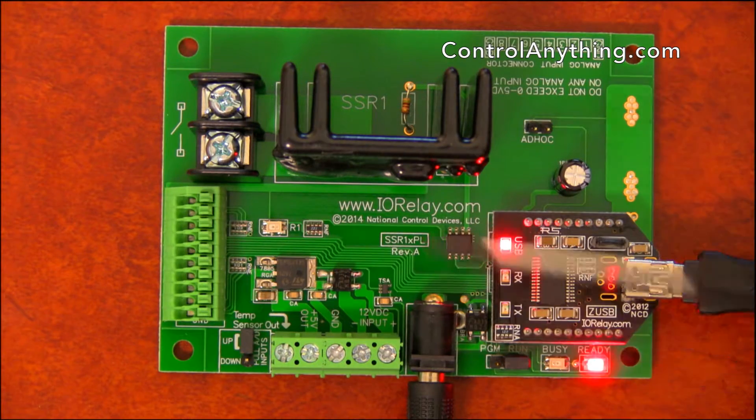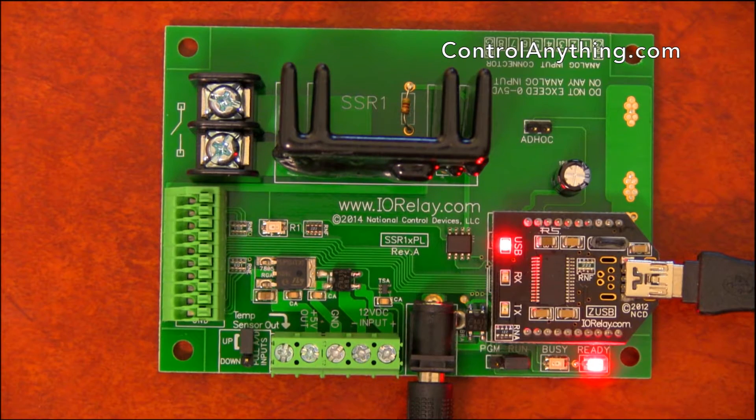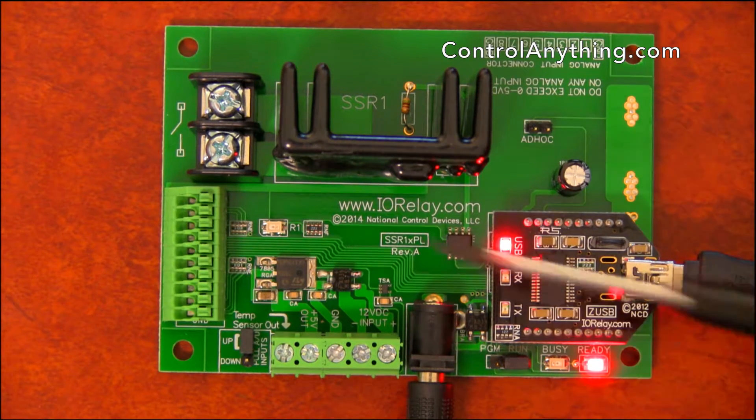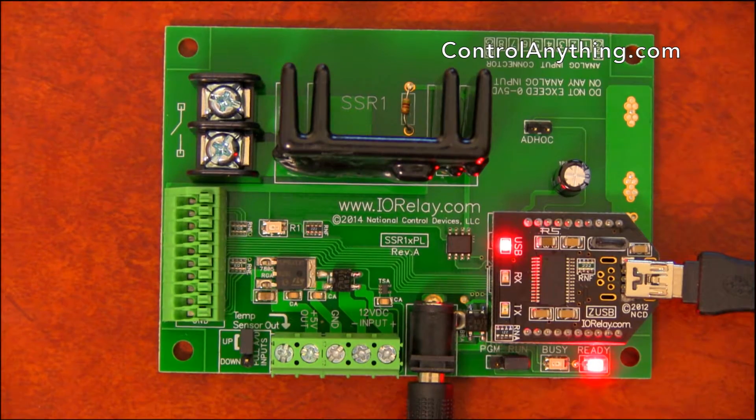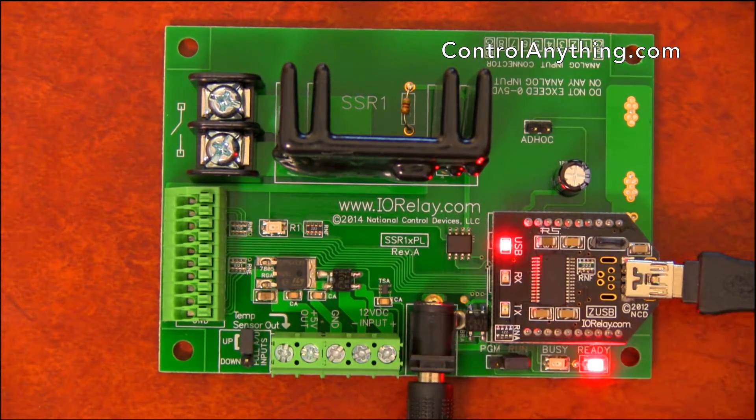This particular controller also includes eight channels of analog-to-digital conversion. These A-to-D converters are really useful for measuring sensors such as temperature, light, humidity — any kind of sensor with a 0 to 5-volt voltage range. These A-to-D inputs have to be pulled high or low; this is just a rule of analog-to-digital converters — you don't leave them disconnected. We include 10K resistors on the board, and these resistors can be pulled high or low through the up or down jumper.